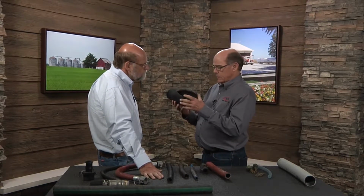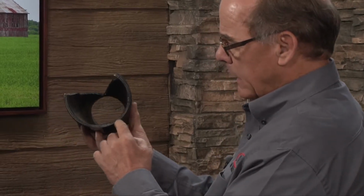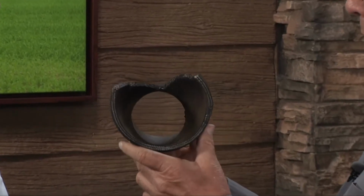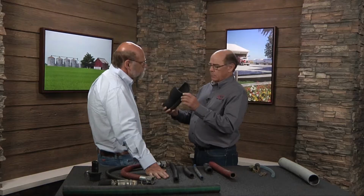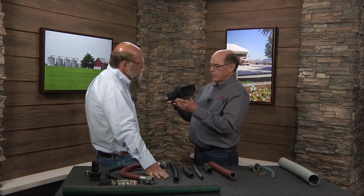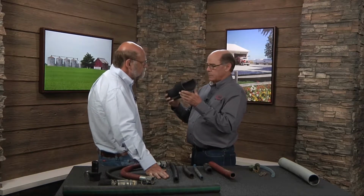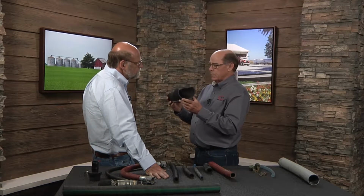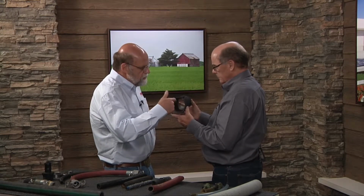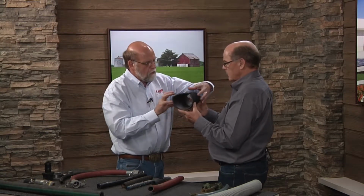This hose is a suction hose in its own right because of the double nylon braiding that we have here. It also has a wire reinforcement through it, which gives it the capability of pulling a full vacuum and acting as a suction hose. But with this nylon braiding and the wiring and the outer skin around our inner tube, it's also a higher pressure hose. And it can be used on the discharge side of pumps, on sprayers and transfer trucks both. Based on our experience, this particular hose, it would be difficult to actually have chemical eat through it and break it. So most of it would come from the outside?